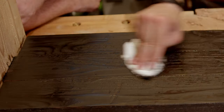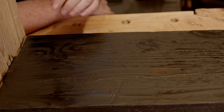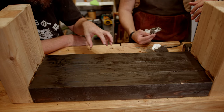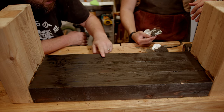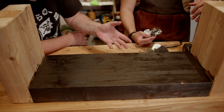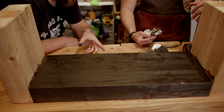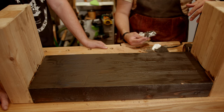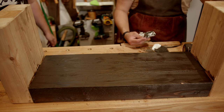That's really incredible because we haven't lost the alligator crackle, but it's given it this finished look where it doesn't look rough and raw like it's going to come off if you touch it, but it still retains that really beautiful look I was hoping for with the Shou Sugi Ban in the first place. Looking at the other sides that haven't been done yet, you can really see the difference. Knowing that it's going to be protected with the Shou Sugi Ban plus the Danish oil, I'm feeling pretty good about that and absolutely loving the way it looks. Let's flip this guy over and do the top.